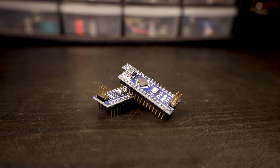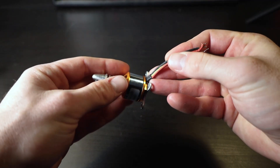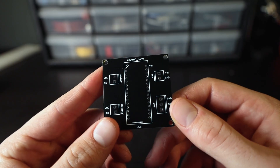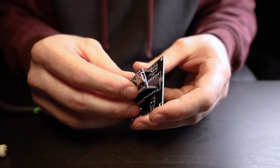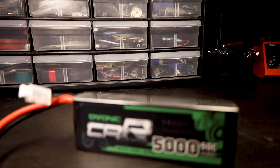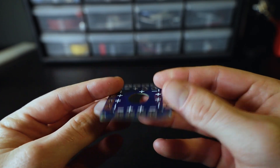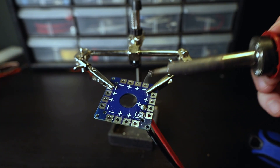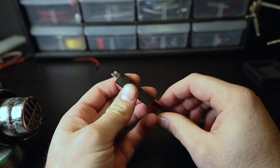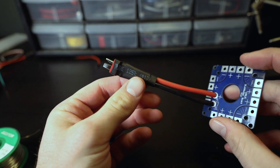For the electronics in this project, I decided to go with an Arduino Nano as the microcontroller, as they're pretty cheap and they come with more than enough inputs and outputs for this project. And I'll have them controlling two brushless DC motors, which I actually stole from a failed drone project I did several years ago. To power this project, I'll be using a 7.4 volt LiPo battery along with a power distribution board to provide voltage to the speed controllers as well as the Arduino Nano. LiPo batteries do come with several risks, so make sure you're taking proper steps to handle them safely — I'll have some links in the description for more information.